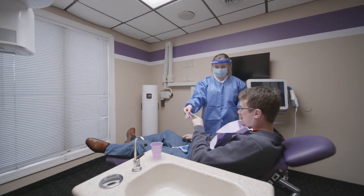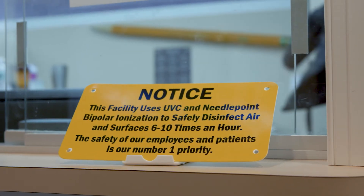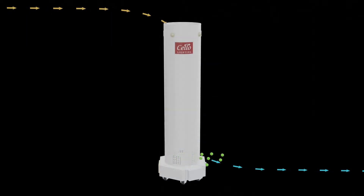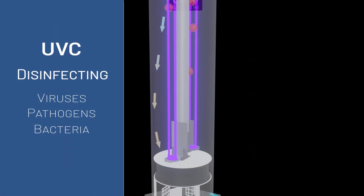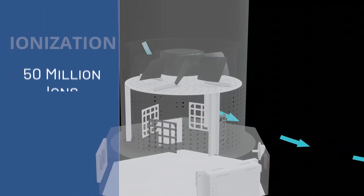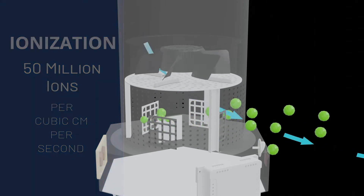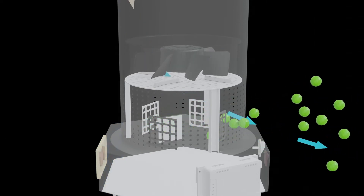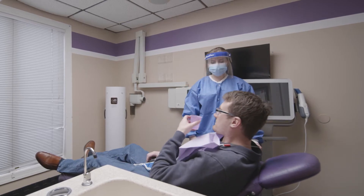When you transition from one patient to the next, if I was a patient going in, I'd want to know I'm going into the cleanest environment possible. It's a great use for the four-in-one product. When a patient is in there with a nurse or with the doctor, the air and surfaces are constantly being cleaned by both UVC and needlepoint bipolar ionization. The air is constantly recirculated — in a typical exam room, the air would be changed every few minutes, so any pathogens in the air would immediately be deactivated.